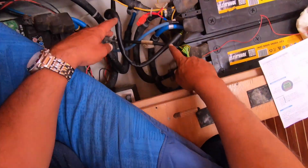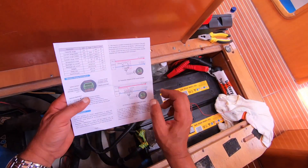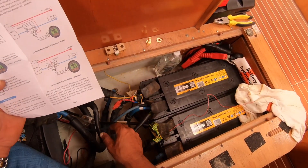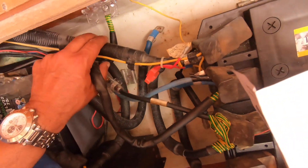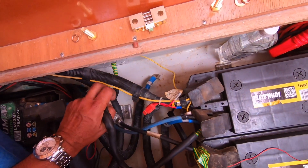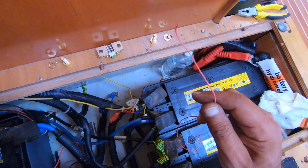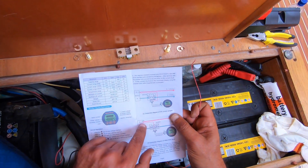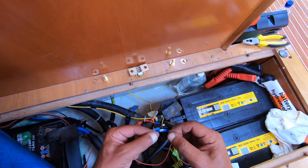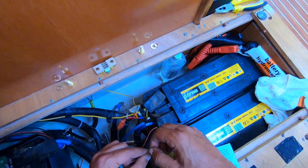Off camera I prepared the cable that will go from the negative side of the battery to the shunt, terminal B. So this will go here. I fixed the mount — it's much easier to unscrew the shunt and fix the housing, then put the shunt back. This is the positive wire that comes from the positive of the battery and will go into the shunt. It's much easier to fix it first before installing the shunt because it will be very tight.